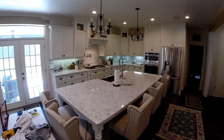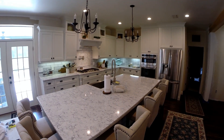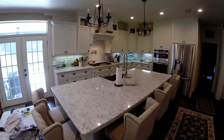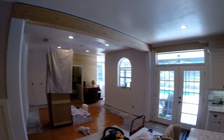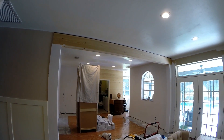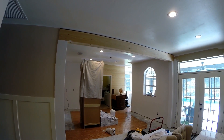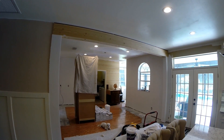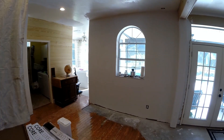This part is just about done — we've been using it now for about a month and everything in here is working. We've got the gas cooktop operational and these chairs in. We've got the beams that are almost done — these need to be sanded and stained. We put three 2x8 yellow pine beams across there, then finished it out with some finished cut cypress. Got the sheetrock done, it just has to be painted now.